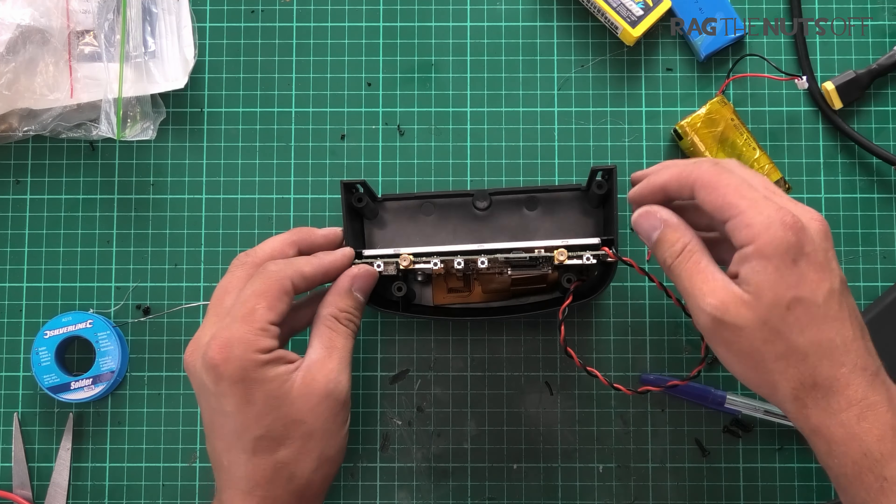I chopped the wires off the original battery to seal it up later. I got myself a pair of 18650s, soldered them up together, and wired in the power lead — that now fits in the back. However, I had the same issue around charging at the flight line, because it has a stupid little tiny bullet connector which is absolutely useless. So I chopped that off and put an XT60 on there, then added some servo wires so it's clear where the main power comes in.